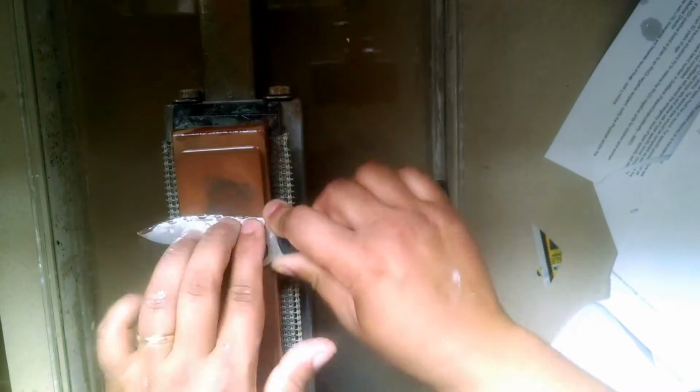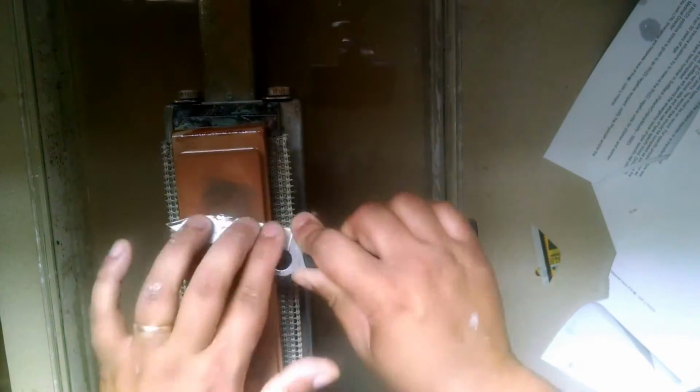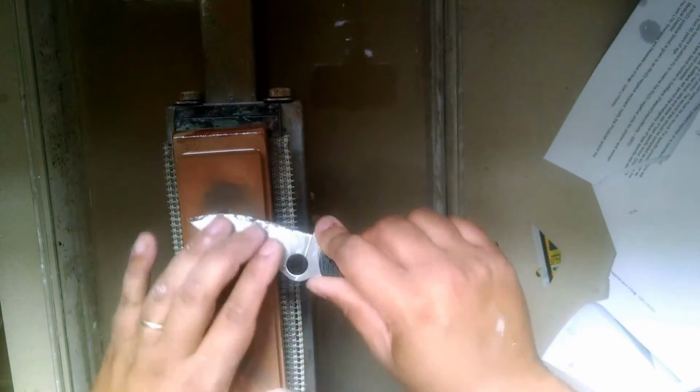Let's go ahead and switch to this side now. Using some moderate pressure, you guys can see that black stuff right there. That's actually swarf, metal filings being removed. The reason why water stones work so fast is because they remove that layer of grit and reveal fresh grit as you sharpen. So this is going to be ideal, probably one of the faster ways to sharpen. The problem being, though, is it's messy. It takes some time to learn, but once you do it, it's definitely probably the most liberating way to sharpen. You could sharpen anything.